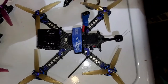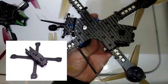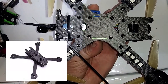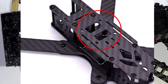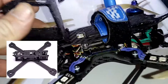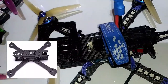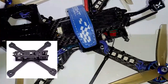You can see I've got the iFlight stack, iFlight ESCs, iFlight board, iFlight motors. This is actually an iFlight TrueX clone - it's about twenty dollars cheaper than the actual iFlight frame. The difference is the real iFlight one has an option for a 20x20 board from the bottom, while this clone has that option from the top. I didn't want to do that - I like a 30x30 board. I just do. I like the bigger feel; it's easier to solder, easier to repair, easier to get in and fix stuff.